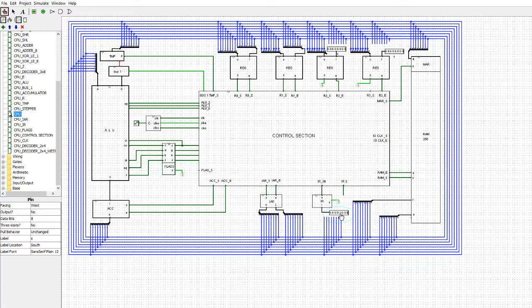Okay, so that's adding the value in register 2, and let's say we're going to add the value, and this will be reg B, so we'll make this register 3. So we're going to add the value that's in register 2 onto register 3, and you'll see from the wiring inside that we're going to leave the value in register 3. So that's register 0, 1, 2 and 3. So we're adding this value onto that value.